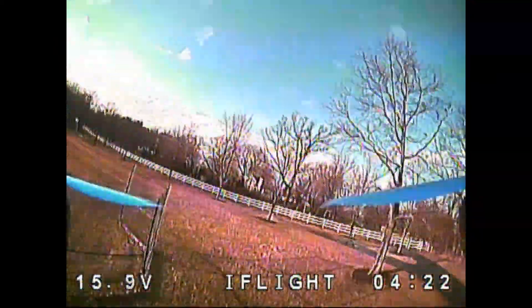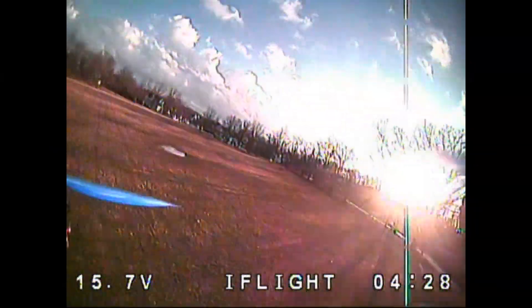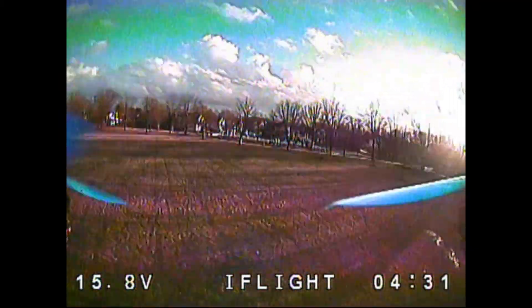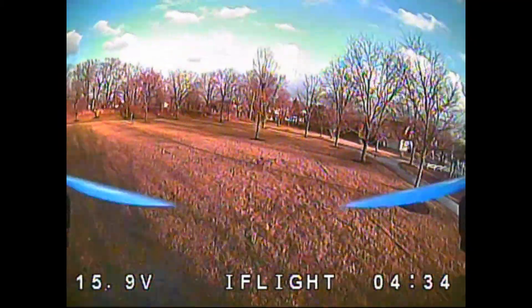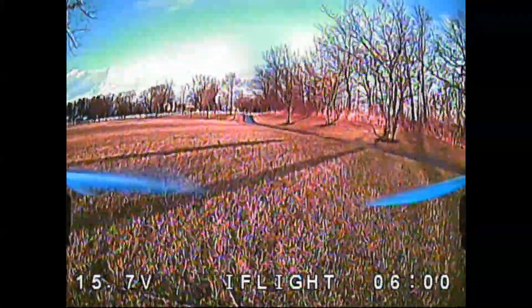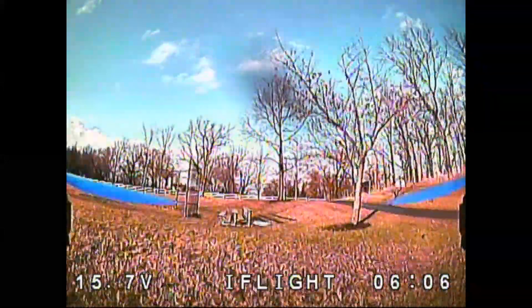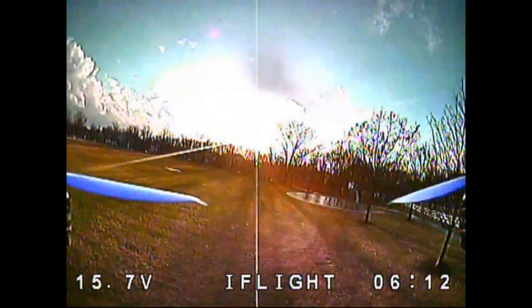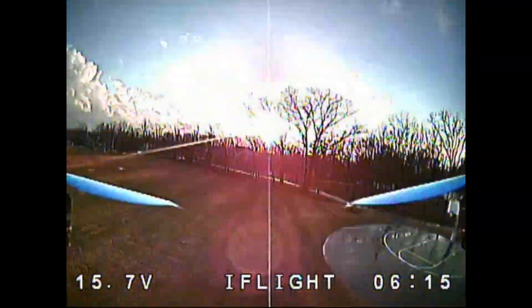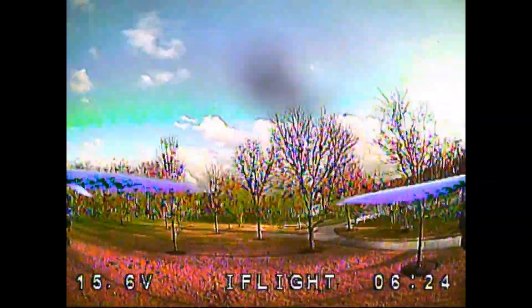I think people made the decision to go to larger and faster motors above the 2205 motors way too fast. I think the 2205 motors give plenty of speed at high efficiency with lots of acceleration, as long as you keep the model light. This model is fast, but I don't know how fast — I'll find out once the racing season starts and how durable it is. I'll come back with a part three. I've listed the components in the description below. If you have any questions, please ask those in the comments below. Thanks for watching and I'll see you on the next build.